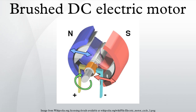Permanent magnet motor. A permanent magnet DC motor is characterized by a linear relationship between stall torque, when the torque is maximum with the shaft at standstill, and no load speed, with no applied shaft torque and maximum output speed. There is a quadratic power relationship between these two speed axis points.